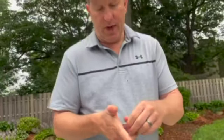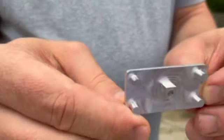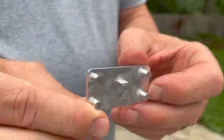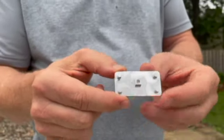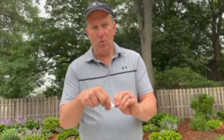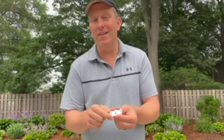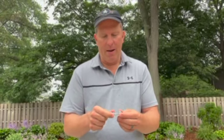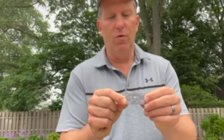Now here's a cute little guy. This is for the quick slide system. We don't have the same interference points on the quick slide system. So we've got these four points where it's designed to be able to go into the round part of the extrusion. This square here is simply a place for the tool to be able to pick off and for locating. And once again, we've got a hole in the center and that's for hanging it for powder coat. So we designed this guy to pop in to the end of the quick slide system and you get a beautiful look.